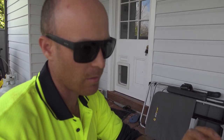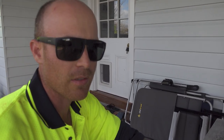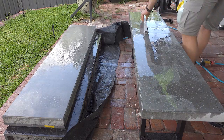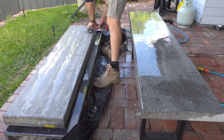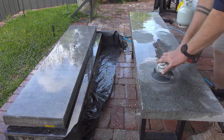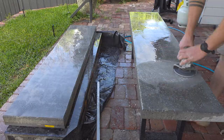I've just marked all the high points. Another issue when you're honing is that the pads will always go for the softer concrete and dig holes. I've done a lot of sanding with timber but concrete really digs holes where it's soft, so you need to be consistent with your troweling to get an even surface. Wet it down for a dust-free work environment, then use a straight edge to mark all the high points. I've ground down all the high points and now I'm grinding in a pattern — up and down, then left to right. Clean it off, mark high points, grind the high points.